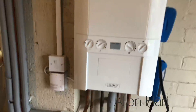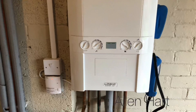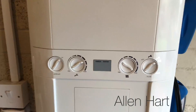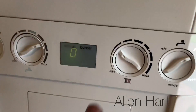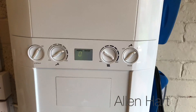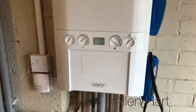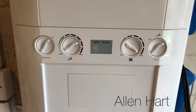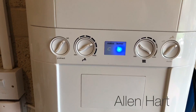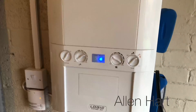First of all we'll turn the power on and we need a call for heat to do this. I've set that to about 10 o'clock and I'm just going to override the stat. Then we'll see this is C so that's calling — blue lights come on — and then what we've got to do is turn this quickly, like that, twice.